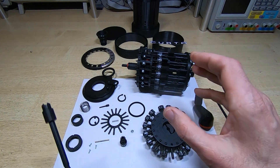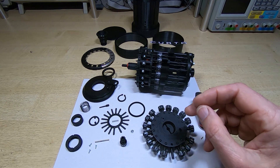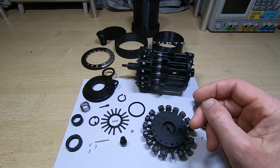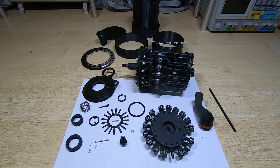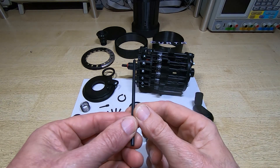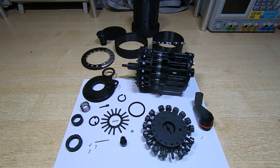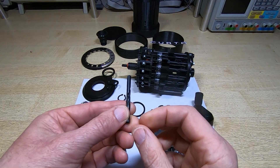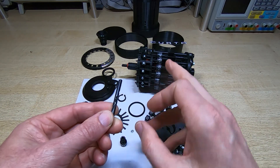So for a lot of the parts, instead of scaling by a uniform 66.6% in X, Y, and Z, I might scale X and Y at 69.2% and Z at 66.6%, just to make sure the finished product is the right size with the right surface texture. The surface finish on this is much smoother than on the larger version. I polished these parts up so they're almost like glass — that's what we have to aim for when getting down to this sort of size.